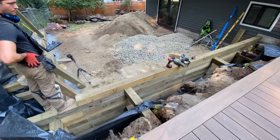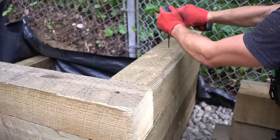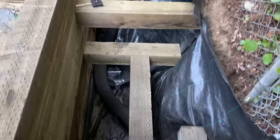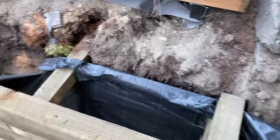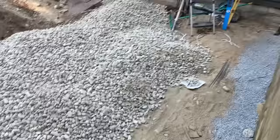I install the last few rows of timbers and after I get to my finished height of four feet I stop and look back — man, that retaining wall does look good. The full height is taken care of, and as you can see, one of the most important things is our deadheads. We still have to connect a couple horizontal deadheads in the corners, but this wall is extremely strong and very durable.